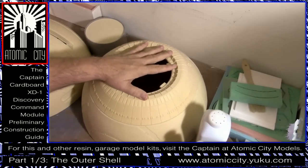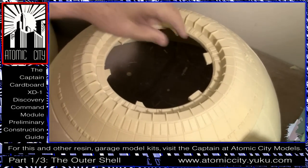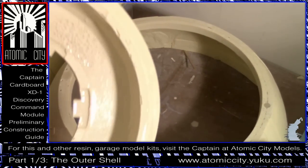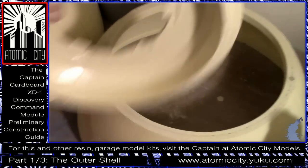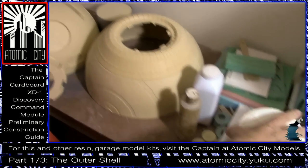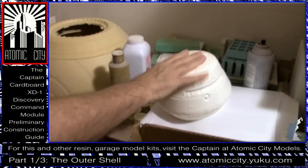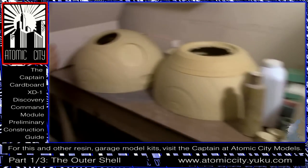This particular collar doesn't have the correct features to lock into this. I mean, they're partially there, but the thing was poured short. You can see bubbles on the inside where it was poured short. So this thing will engage, but it won't lock properly. On the other hand, it's not really necessary because you don't have any weight here. And the only other thing that goes on back here is what I call the spools and plate.